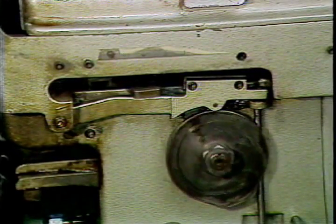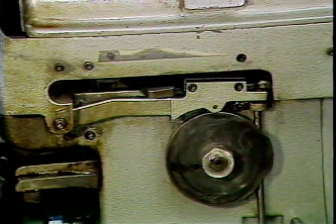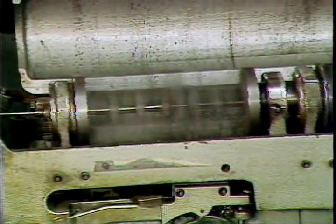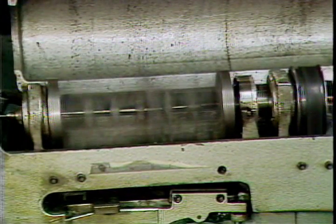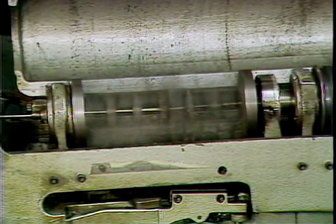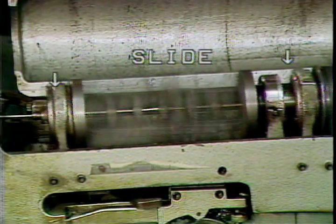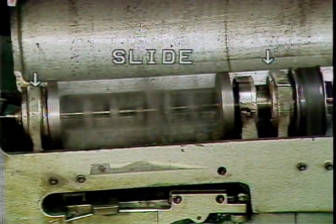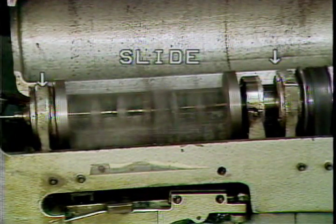The amount of stock straightened in one cycle will depend upon the total length of the finished part being produced. If the travel of the straightener slide is too short, the stock will not be correctly straightened. If the travel is excessive, the slide will make the straightener jaws repeatedly straighten the same portion of the stock. This is the stock straightener slide. The purpose of the stock straightener slide is to control the amount of stock straightened on the backward travel of the straightener slide and rotor.